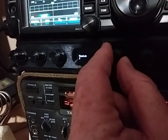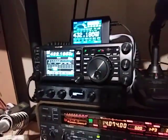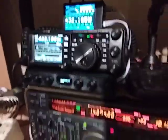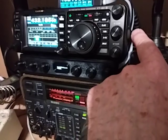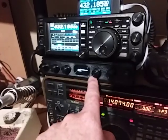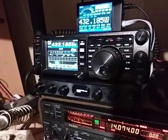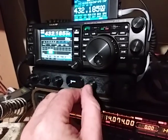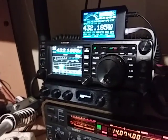So we're adjusting that setting here. They both work together: the Cat Knobs are plugged into the transceiver first from the transceiver's RS-232 CAT port, and then another cable runs from Cat Knobs, which has a pass-through port, to the Cat Display. The only drawback is the display does not update while you're turning a knob — once you've finished turning a knob, the display will update. But apart from that, the system is pretty seamless.